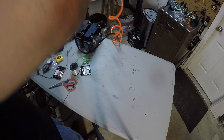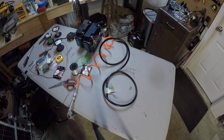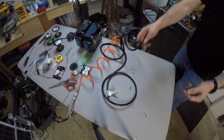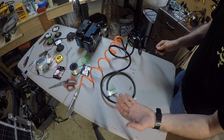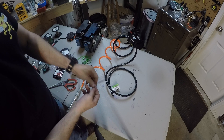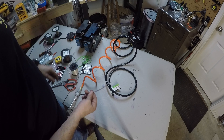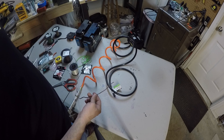Never mind - it's already done, the baggie has already come out the other end. So we have the little piece of baggie with the fishing line run through the fuel hose. What I'm going to do is tape, tie, and everything else this wire to this piece of fishing line and fish it through the fuel hose. If you had two people it'd be so much easier, but I'll do it by myself.